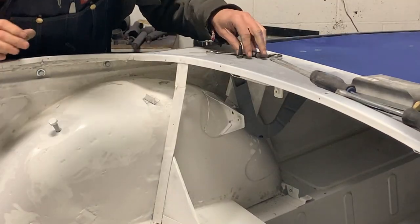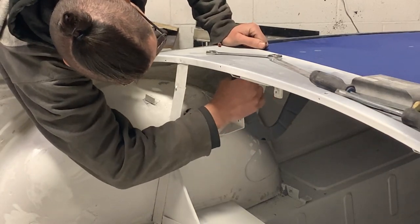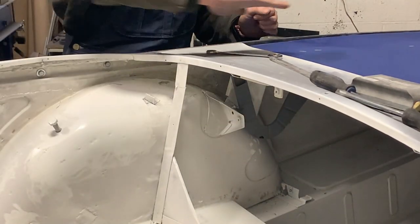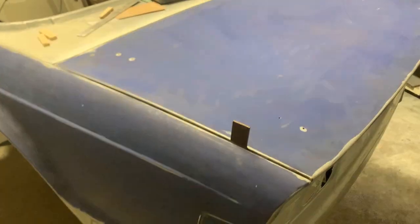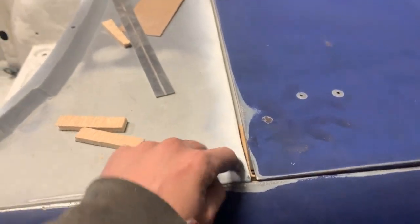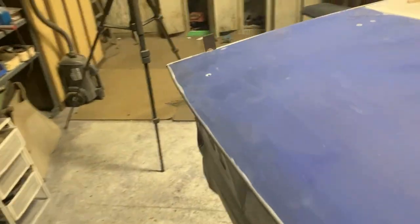Let's quickly put the other ones too. From here we can adjust the height, and from the ones on the actual lid we can adjust the front and back and left and right position. The height we can adjust from here. So now with the hinges loose, I shimmed it here and there — I put shims underneath here to keep it at the height I want, put shims here to keep it where I want the gaps to be, and here too, and now I can reach inside and tighten the hinges.